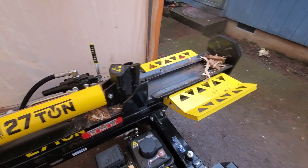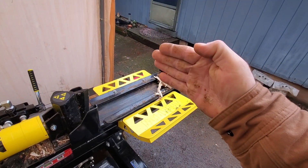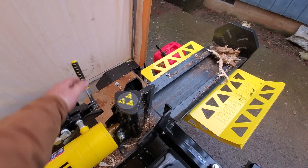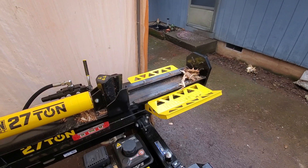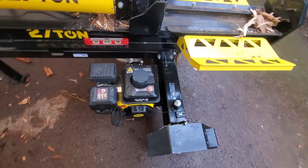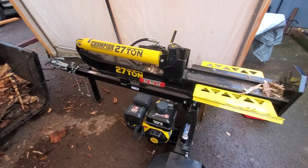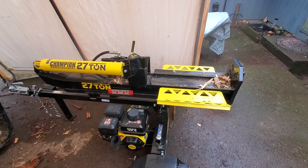If you're thinking of doing a stroke limiter, just don't even waste your time — just get a piece of wood, a block, and set it at the desired length at the very end. This has an automatic detent where if you have it in reverse and it gets to the very back, it automatically pops into neutral again. So instead of drilling, I'm just gonna put a block at the very end to limit the stroke. I would have liked a bigger gas tank, but that's fine. Hour meter and definitely build that little protecting shelf to cover your hydraulic pump and filter. That's a quick update on my new hydraulic splitter — let me know what you think, questions and comments below, share and subscribe. Love you guys, bye.